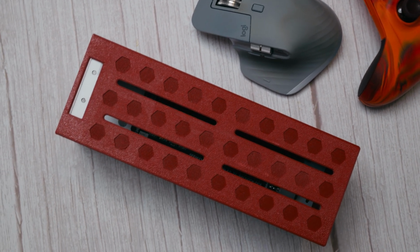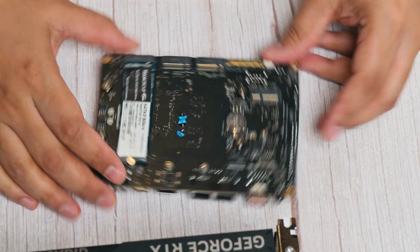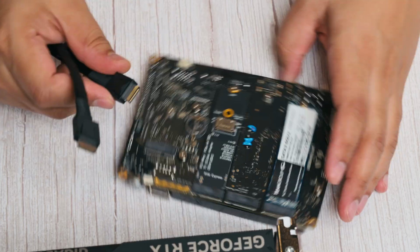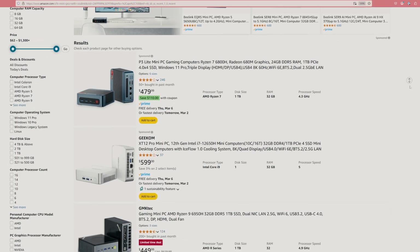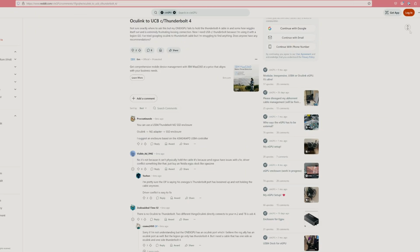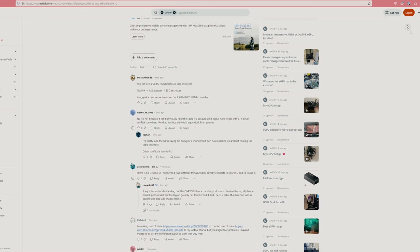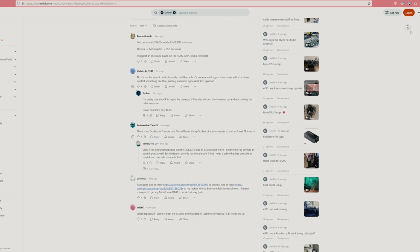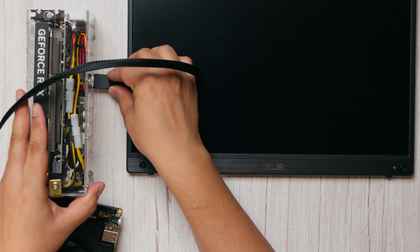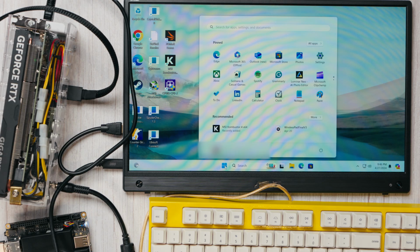For testing, I used my Latte Panda Sigma board, connecting the included NVMe-to-Oculink adapter to one of its NVMe slots. Many modern laptops and mini PCs now come with built-in Oculink ports, and if yours doesn't, it's not difficult to convert a Thunderbolt port to Oculink. I'll be covering that in a future video. The setup process for this is identical to the previous eGPU setup I showcased, which I'll link below.